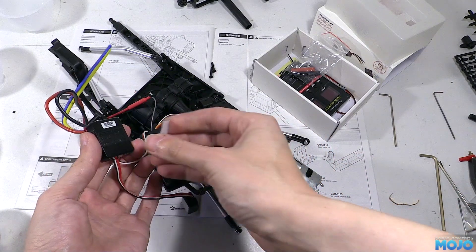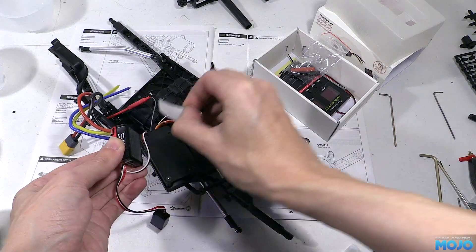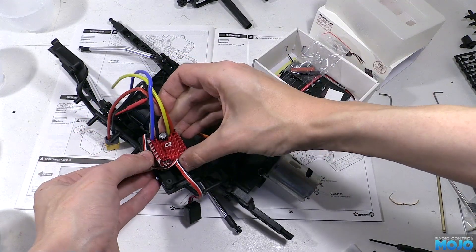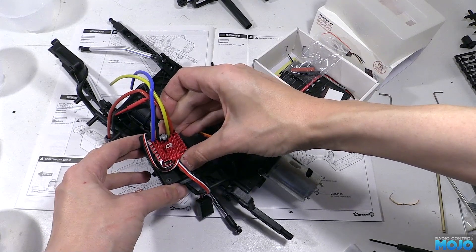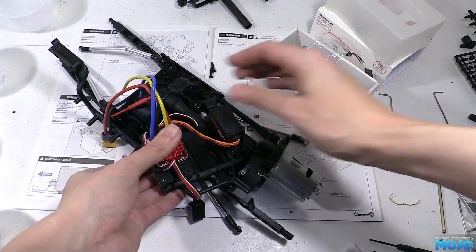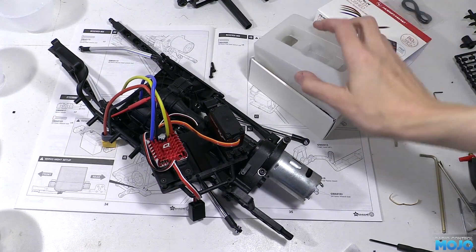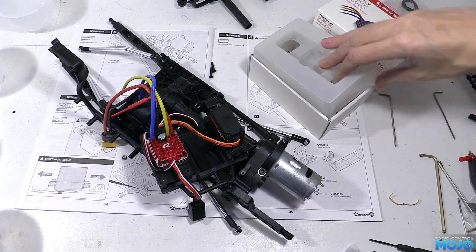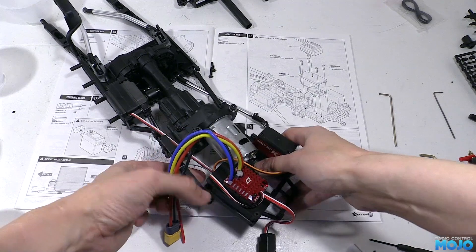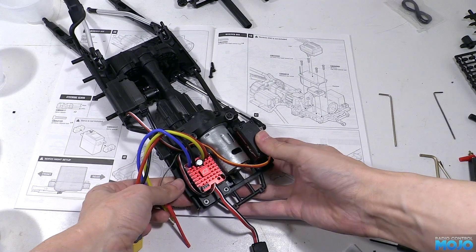Stick the tape to the bottom of the ESC and pop it down towards the rear of the lid. If you really want to make sure it won't fall off later, give the surfaces a very quick clean with some alcohol first to remove any grease and oil. We'll leave the switch hanging for now as we're going to need to stick it somewhere we can actually get to the button when the rest of the cage is fitted. Before we get to the next bit we'll just loosely refit the electronics tray in its proper position — we won't bother with the two screws yet just in case we need to rejig something.